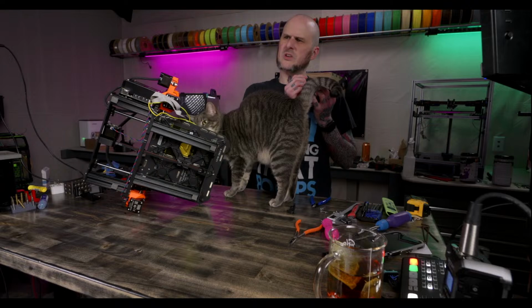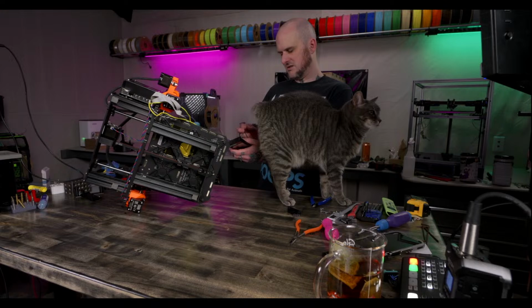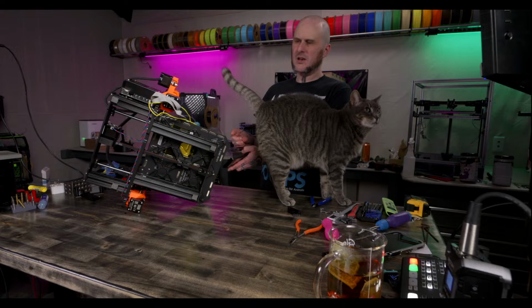With the Creality enclosure, I had to put a couple blankets on it to retain the heat. Huh, interesting. I wonder what bed temps are you running? I print ASA at like 105 to 110 on the bed. I know a lot of people run more like 90, which I think is just silly.